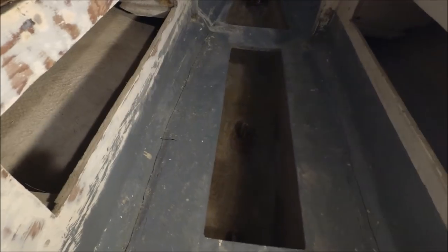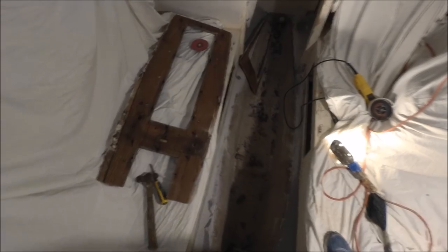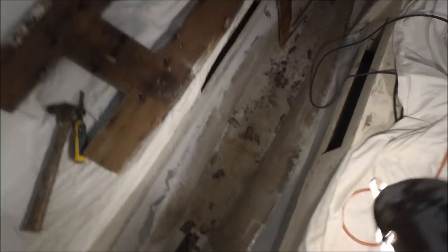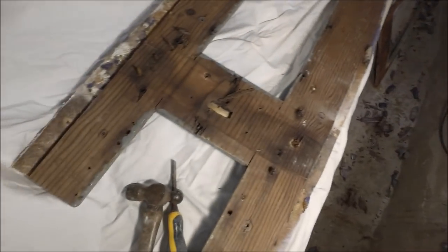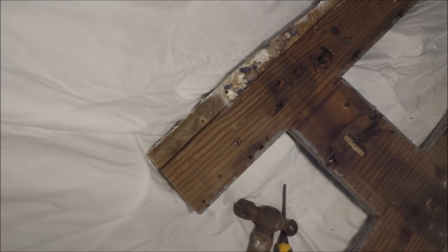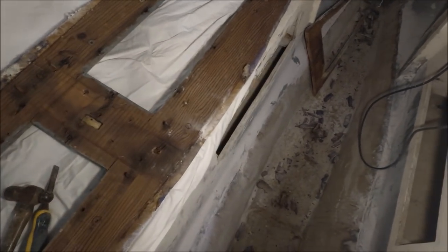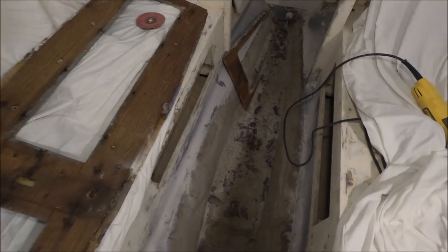So I'm going to cut out what's remaining of the cabin sole, and then we can clean up in the bilge and cut off these ballast eye bolts — those are just for hoisting the ballast in place. It's encapsulated ballast so it doesn't have any keel bolts. Here you can see what was underneath the old cabin sole: rotten cracked wood and poor fit along the hull with an inch and a half gap. I just cut out the fiberglass layer on top with the angle grinder and it popped right out.